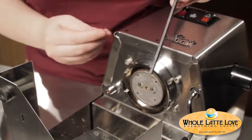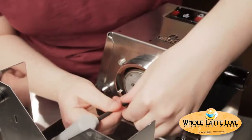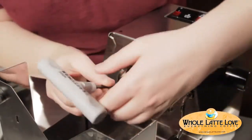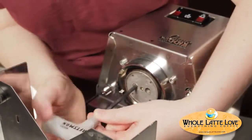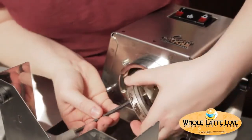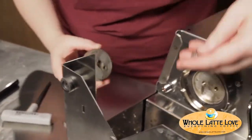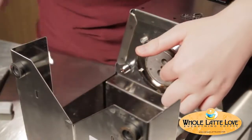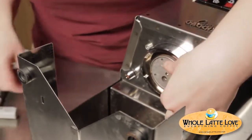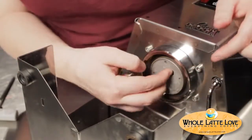The next thing you're going to do is take your 5mm Allen key. There are two 5mm Allen bolts, and you're going to remove those. The shower holding plate should just fall right out. This is another thing that can stick — if it's really stuck in there with both bolts out, you can take a screwdriver and pry it out. Or if it's really stuck, you can take a pair of needle nose pliers, stick the two ends in there and turn it. It'll come loose.